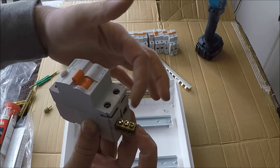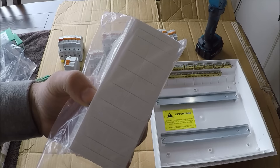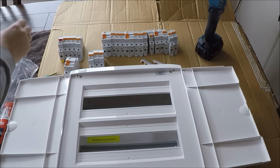There is another way of doing them using these little plug-in neutrals — you can plug those into the neutral and the bottom of your RCD, and then your sub-circuit neutrals just come straight out of these. I've hardly used these; I don't think they're as tidy, but they can save a lot of time. These covers are just for if you don't use the entire 15 ways and you have gaps between your breakers — throw a cover on the gaps.